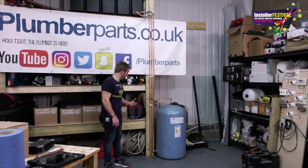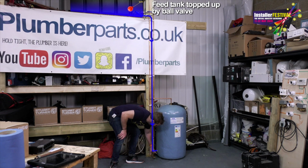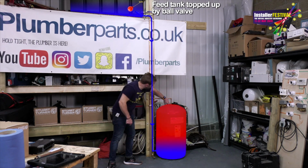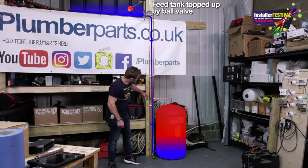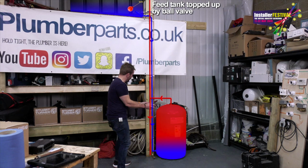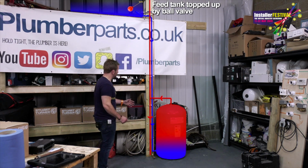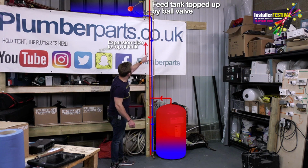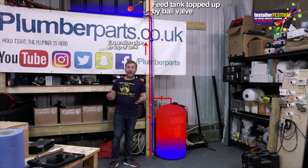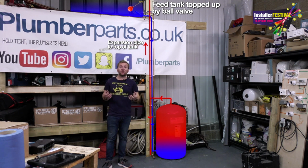Don't hide it away. Then we'll have our cold water enter in at the bottom here. It goes up through here, it's heated up by our immersion heater, and then we've got our hot water pipe just out there. It's going to go down and then probably into our shower valve that's going to be around here somewhere, or I might have it over here, depends. But also we've got our expansion pipe going up, and that'll go over just out of shot into the top of the tank.